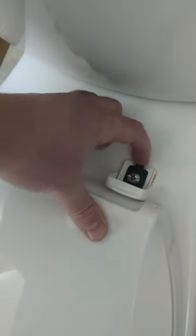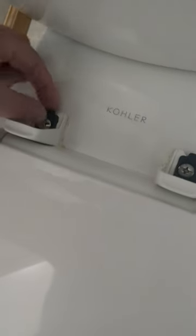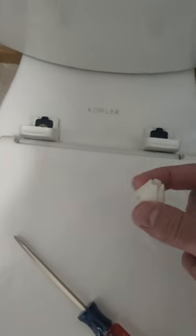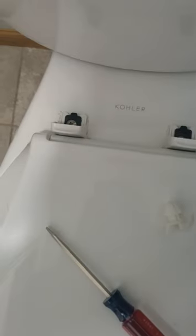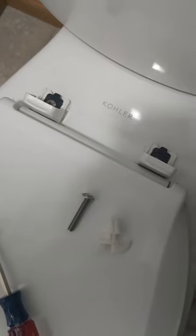I'll pop this up — easy-peasy, no screwdrivers needed. This one here looks a little different actually; it doesn't have the little quick-release mechanism, so we'll just unscrew those and see what happens. The old one had a standard wing-nut situation on the bottom side, so I just held that still with a screwdriver and unscrewed it to loosen it up. Now it just lifts right off — a different style for the older Kohler toilet seat. I'm going to take the other side off and clean it up a bit because it's a little nasty under there.